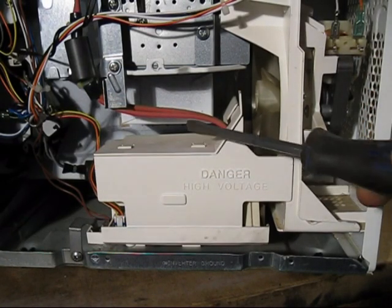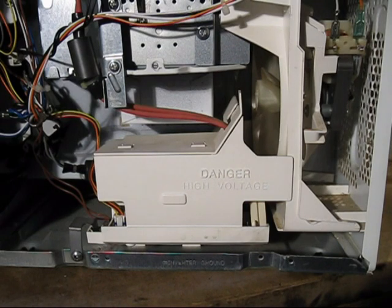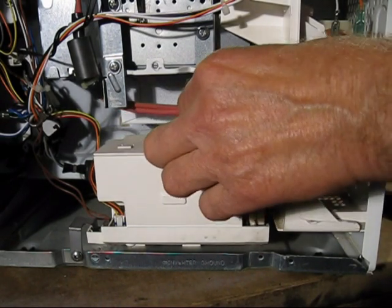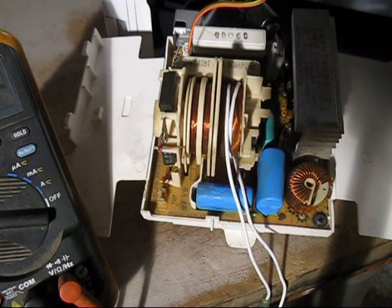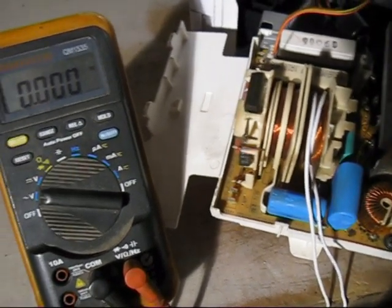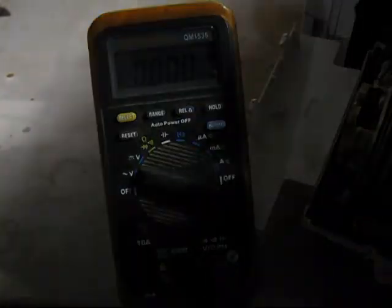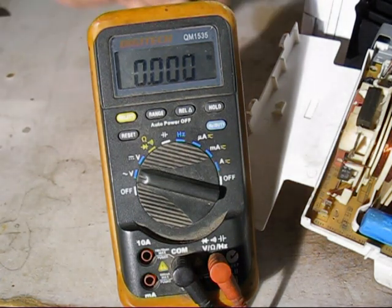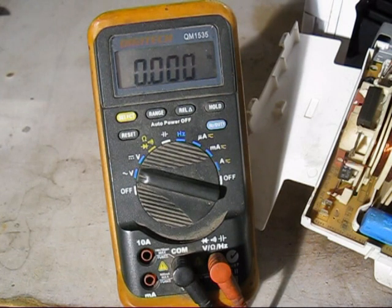The cover has been taken off - this is the part we want, that's the inverter. We'll get rid of the high voltage wire. Here is a good close-up look of the inverter. I've wrapped the wire around the primary side of the transformer and it's connected to my meter. What I'd like to know is what frequency it runs at, so I'll have to run it. The frequency was about 30 kilohertz or just above it.